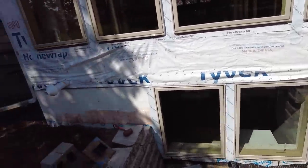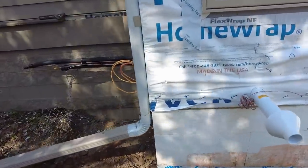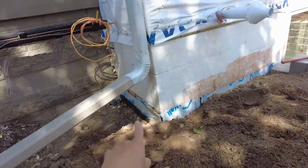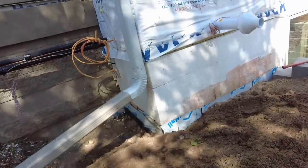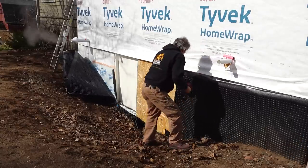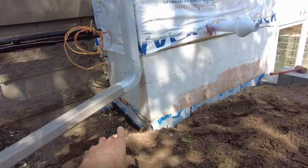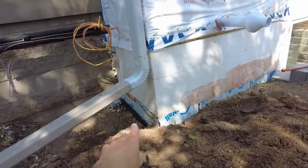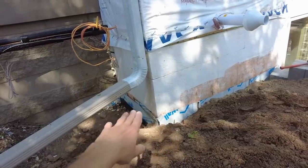So a little bit of prep work that we did a couple weeks ago actually is when we left the foundation over the winter, we had our dimple membrane, the black mat, all the way up, so it protected the ICF through the whole winter, protected from UV, protected it from getting kicked by something. So we trimmed back the dimple membrane to below grade. We have our waterproofing membrane just a little bit below grade as well. So we have this transition area, so it's all trimmed back.